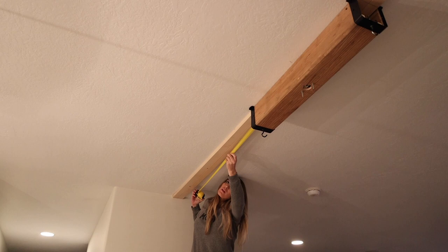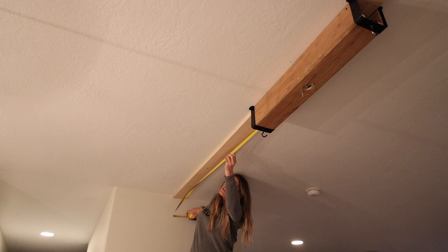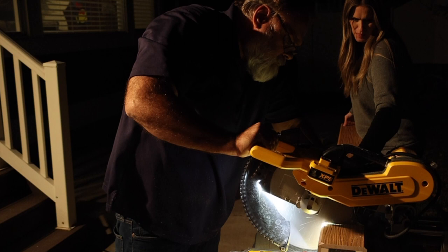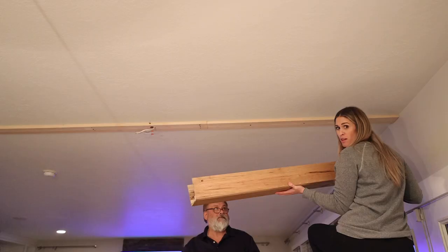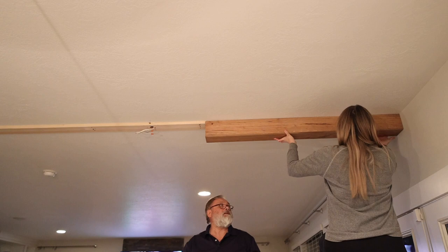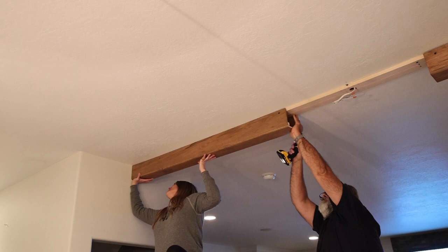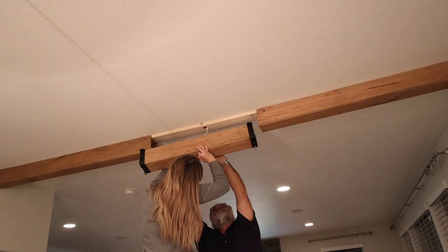To figure out the size of my middle beam piece, I had to determine the amount of space I wanted between my lights. I landed on 32 inches. Once I had that, I cut my middle piece and added the seam covers. I put up the middle beam piece — at this point I did not secure it to the ceiling, it was only temporarily up so I could get my measurements for the two sides. I measured from the inside of the seam cover to the end of my wall on both sides to determine the length of either side. Once I had those measurements, it was time to cut my pieces. I attached the two side pieces with the screws that came with my beams. These beams come with pre-drilled holes where you can attach the beam to the anchor board. These beams are really so easy to install. Now it's time to add my center beam, screwing in my beam and my seam covers. We're almost there.